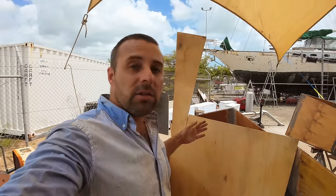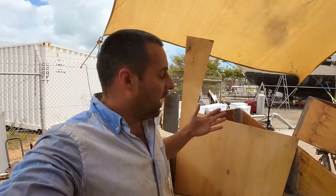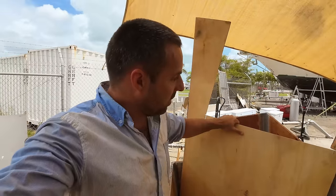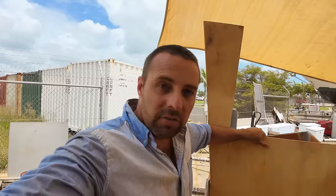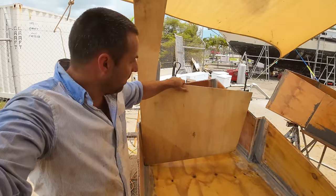It can be really dangerous. It's powerful enough to capsize boats. Many boats have sunk because of it. And there's an incredibly simple way of fixing it, baffles. So basically what you do is you put essentially a divider, like that, basically a barrier that just gets stuck in the middle of the tank.